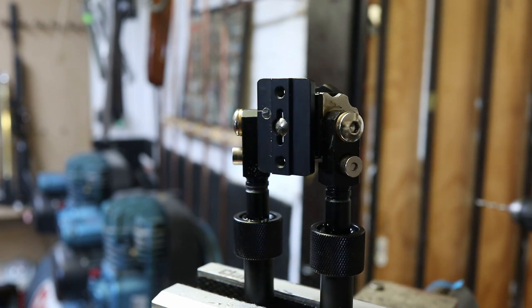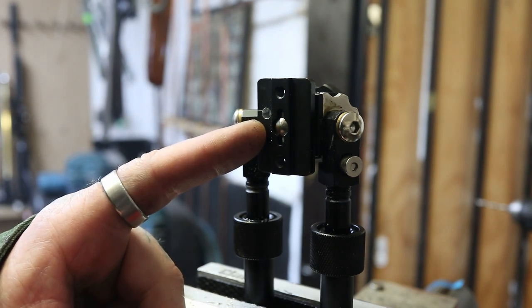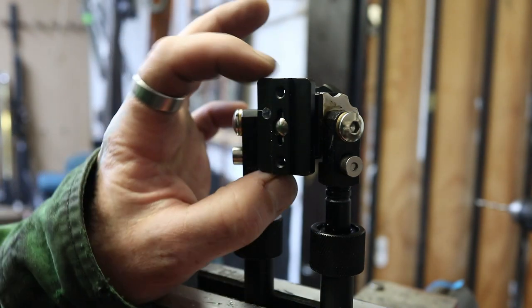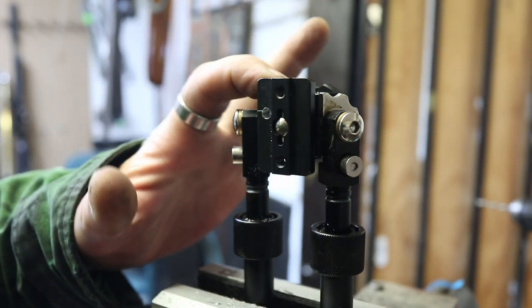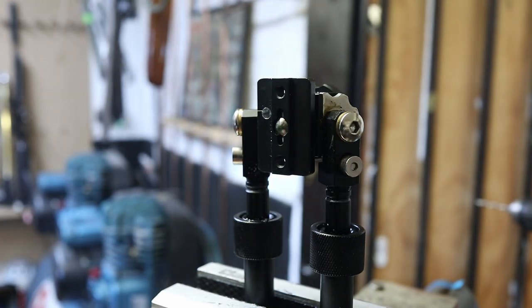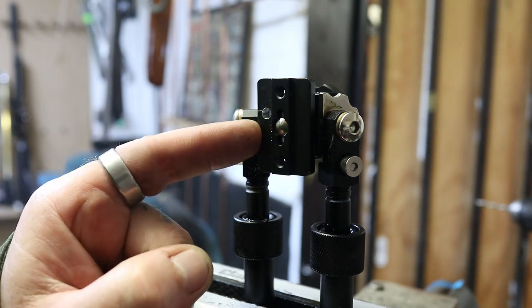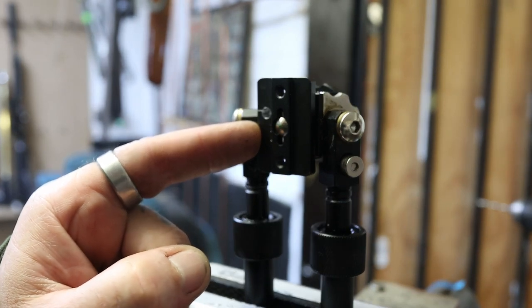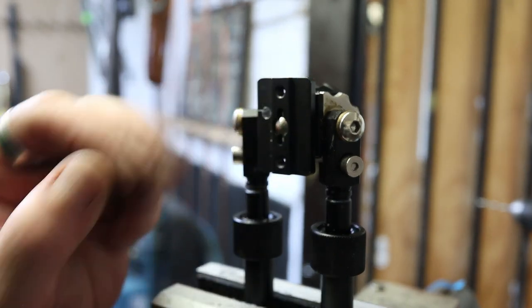Now, I've had to cheat a bit here because my SD card ran out, so you missed a bit. I'm going to explain what you've missed. I've drilled the first hole with a 3.5mm drill bit, and I've gone through this section and into the main section behind it. Because your stud's M4, you need this first section to not have any thread in it, so it's going to be just slightly over 4mm. If you can't get a 4.1mm drill bit, drill it 4, just wiggle your drill around, but don't go into the back section. You'll feel when you've gone through this.